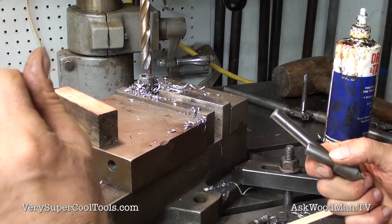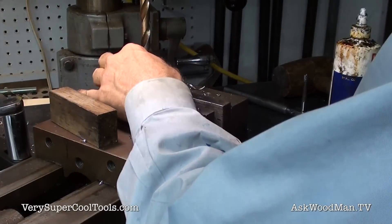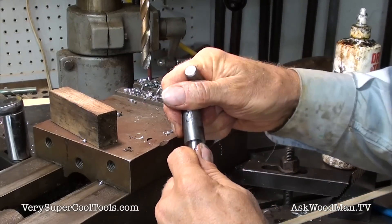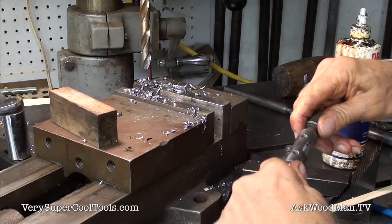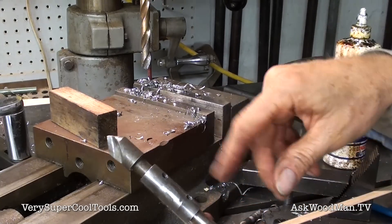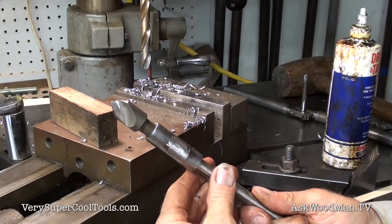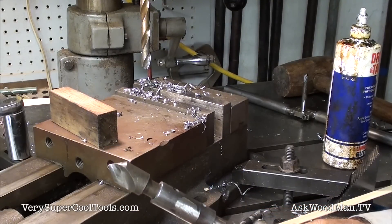Let's see what kind of action I've got here with this sleeve — let's see if it's going to work. I've got some pre-tapped and drilled holes in it, but if those aren't going to be stout enough to hold the drill bit and it spins, I'll just weld this. I can sacrifice this, but that's a nice fit — I can already tell. Let me put a set screw or a little bolt in to hold it in place, then tap this one in and run it in the drill press and see how true it runs. It doesn't have to be perfect — all I've got to do is drill some holes. I have a feeling I may have to weld this, but I don't mind if it keeps me from having to go buy some kind of extender. I think it's going to be fine.